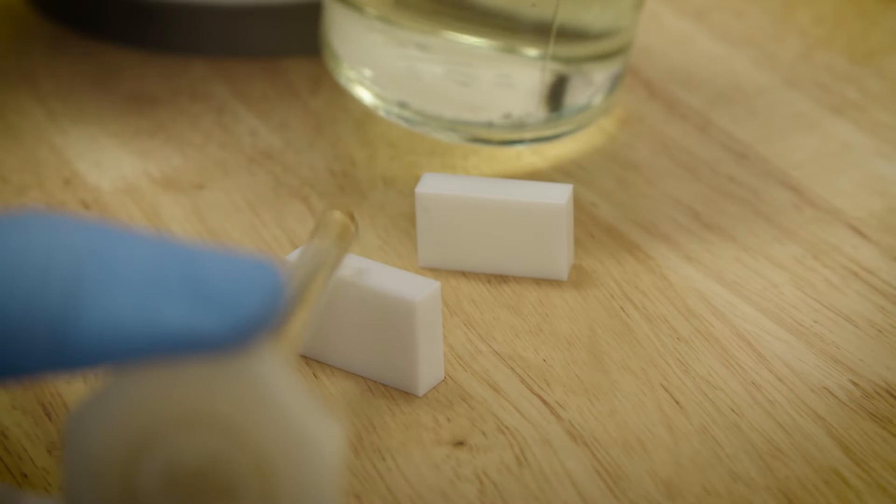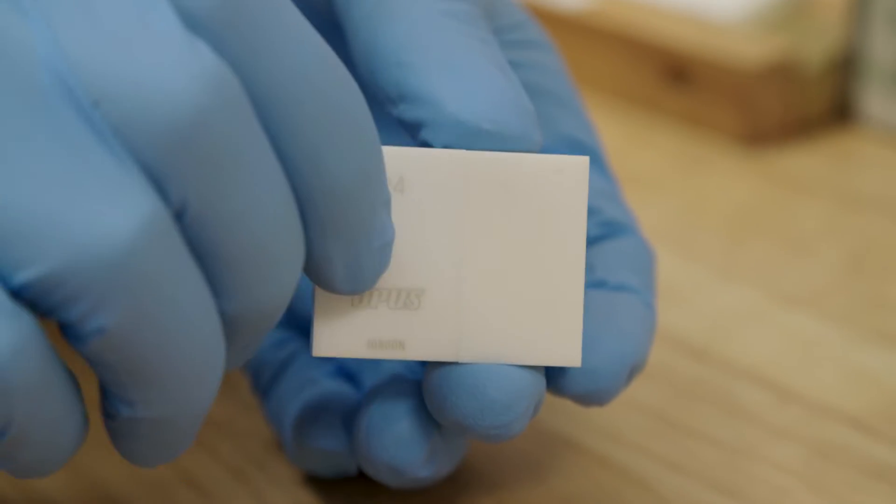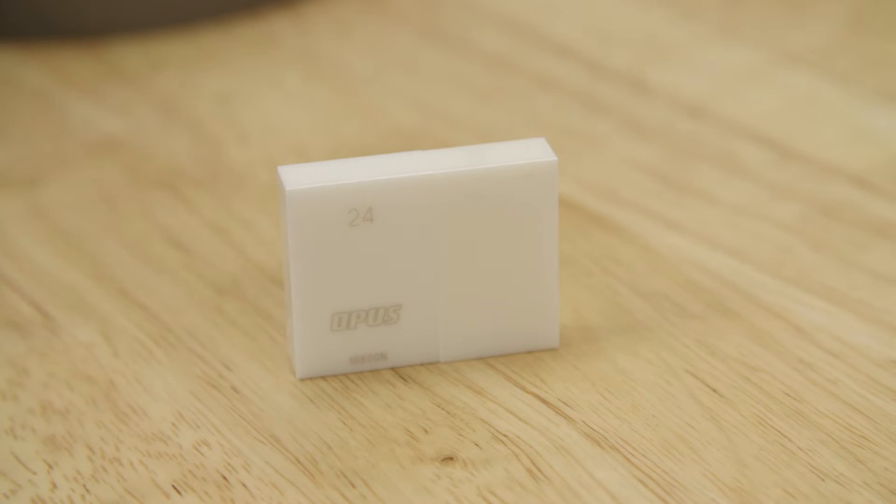The second bit of physics is the ringing oil that you use to ring the gauge blocks, which has a surface tension. So the surface tension basically creates another force holding the gauges together. The third force is due to the fact that you've moved these surfaces so close together that they're basically acting as one metal themselves, and because of that there's a bit of molecular interaction in that interface that bonds the surfaces together.